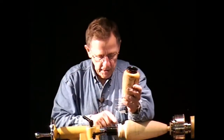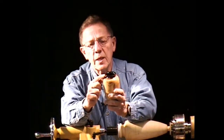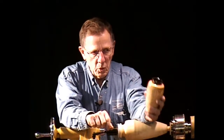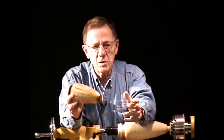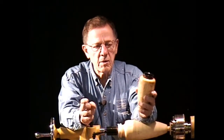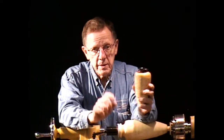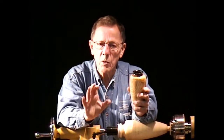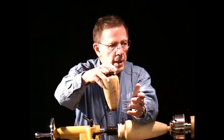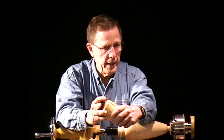What I started out to say is I want to define the thickness of this vessel right here. And when you look at this edge right here and walk over to this vessel to pick it up off the table, whether or not you think it is too heavy or too light is entirely going to be determined by that edge right there. And this tells you how thick this vessel ought to be, and your brain has already decided if that vessel is that thick, it ought to weigh about this. And when you pick it up, you will know. Is it too heavy or too light?